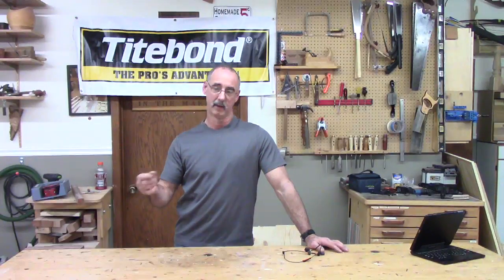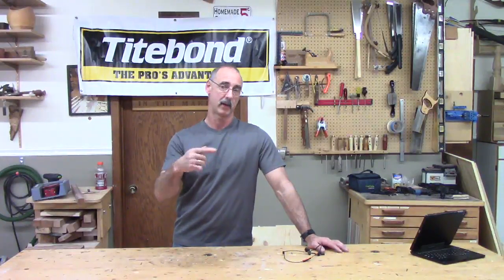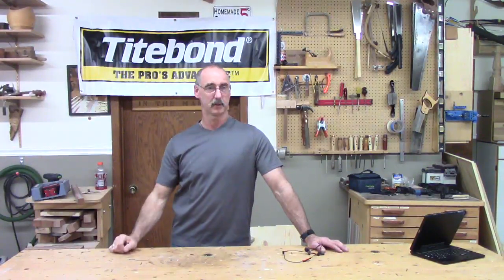Okay, thanks, George. So we have a viewer who wants to know, is there a difference in joint strength with floating versus fixed tenons? Well, that's a great question. So a floating tenon would be maybe a domino, or you just create a mortise and make your own floating tenon. So I would say size for size, if the tenon that you produce on the end of a rail to go into a mortise is the same size as a floating tenon, there should be zero strength compromise because you basically got the same thing. So each should be as strong as the other.